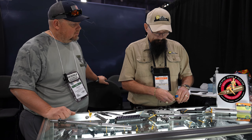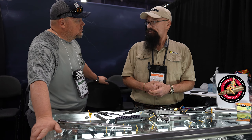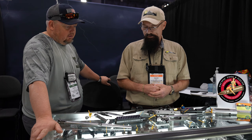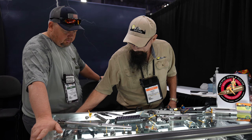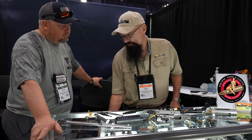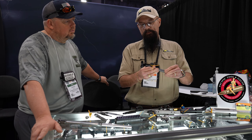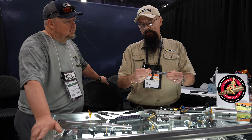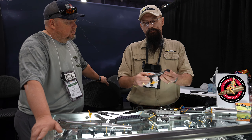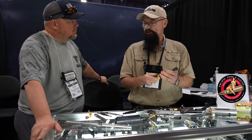The key is when you're done with a job, you want to know it's the best it can be, but also do it as fast as you can to make money — that's what it's all about. And with this, you can still take a factory bolt. We have a jig to true the nose and a driver that you put around it, plus a spud that fits in on the threads. You can true the face, the backside of the lug — whatever — with that kit, and you'll have a really nice action.